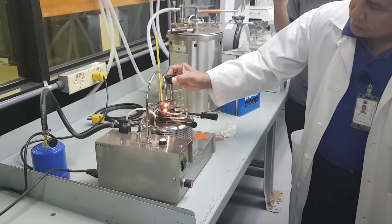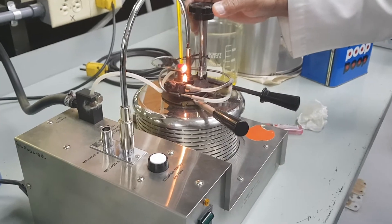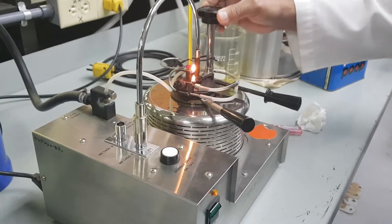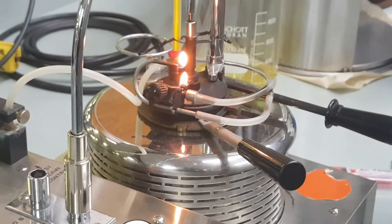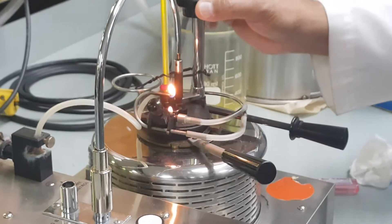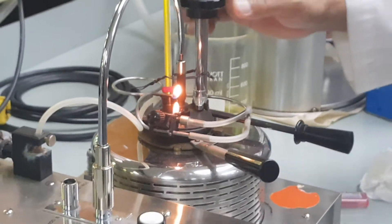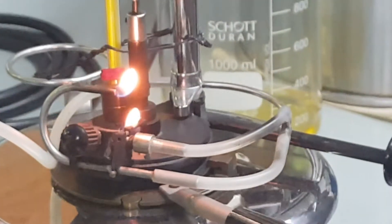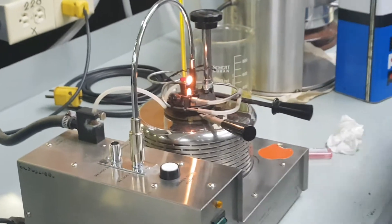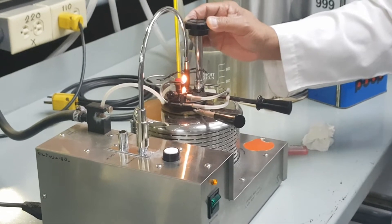At 35 you have to dip the flame like this. You don't need to be quick; you just drop the flame like that. At each increase in temperature — 35, 36, you dip the flame; 37, and so on — until at a certain temperature you see the blue flame coming out. That will be your flash point.